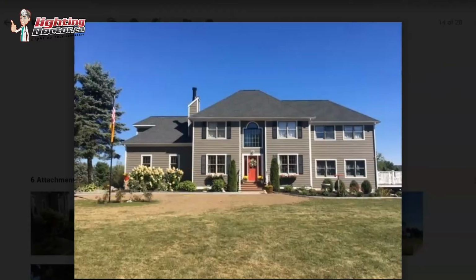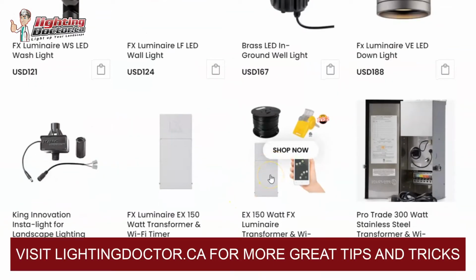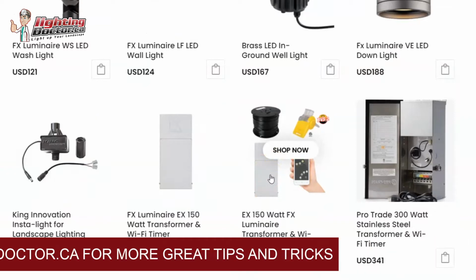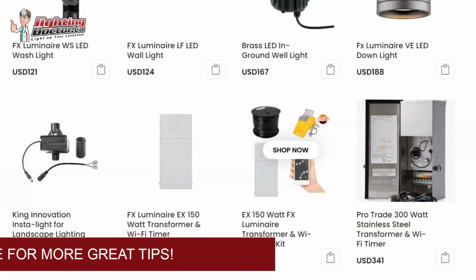Yes, you could definitely fit those all on one transformer. A 150 watt transformer and wiring kit like this would easily handle that load of lights. You'd have your wire, your waterproof connectors and everything. So that's probably what I would do. I think that's very similar to what you were thinking, so I think you're definitely on the right track.